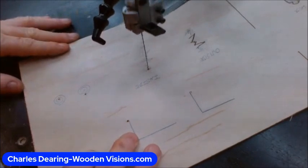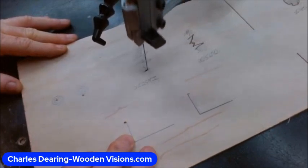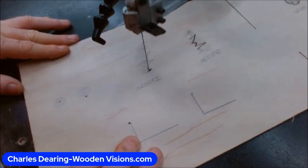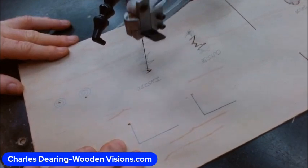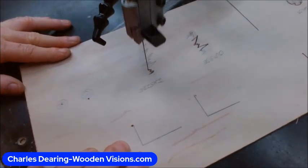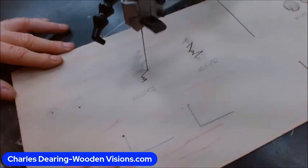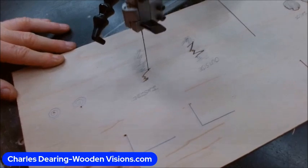I drew this a little bit sloppily. It's the same premise when I talk to y'all about letting the flex come out of the blade — sometimes that helps when you're going into the valleys of cuts like this. I'm going past the cut a little bit and coming back to it. It's harder to see in real time because I'm cutting quickly. As far as the blade speed — going into that valley, right about here I'm letting the flex come out of the blade. Just go slowly if you want the sharp inner corner.